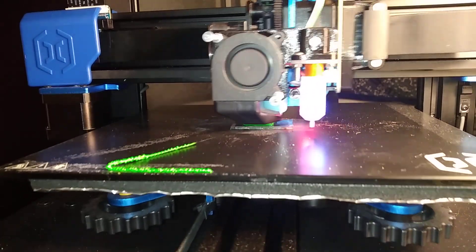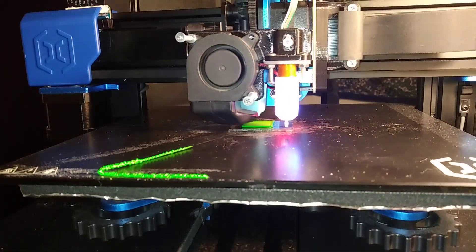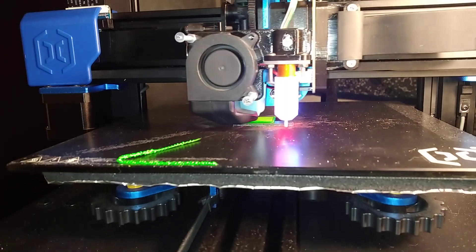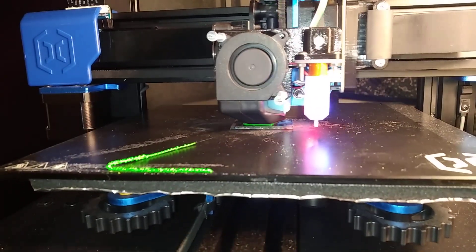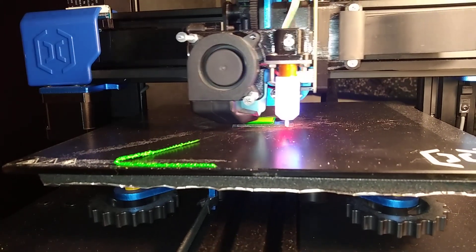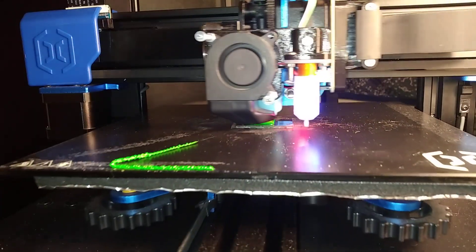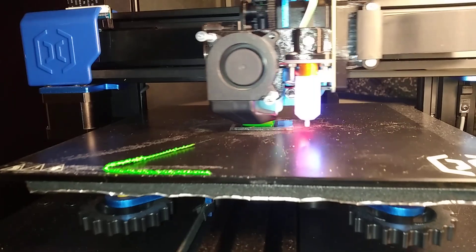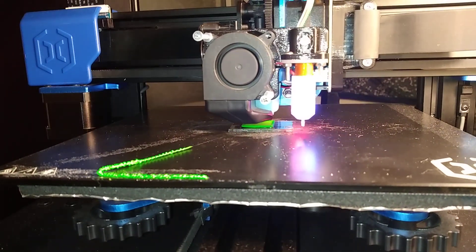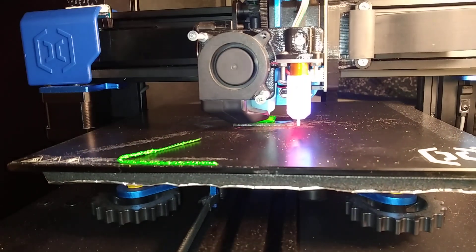This is PETG, not nylon, and so far I'm impressed. I think it warps a bit. I would probably use the thinnest nanotape you can find on the market if you're going to do this, because it's a soft, squishy layer that will deform during the print and cause variations in your dimensions and mess up the geometry. But it works. What I think is really cool is that if the print gets unstuck at any time, it will get glued back again because nanotape is reusable.